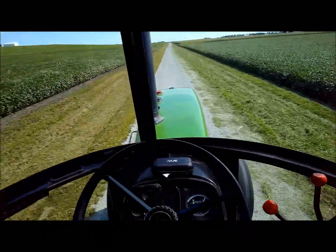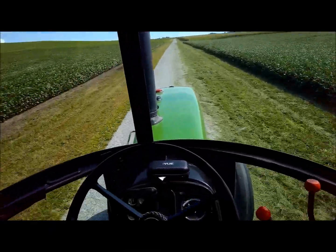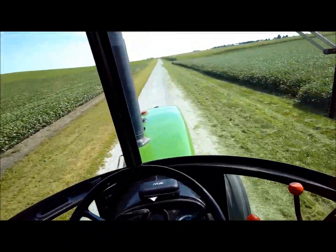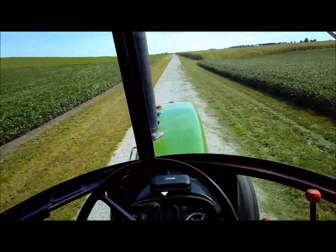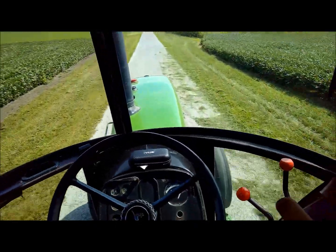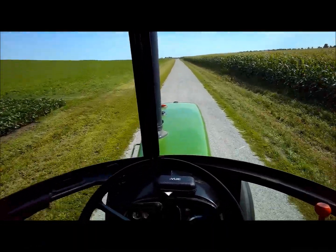he'd actually just jack the cab up 6 or 8 inches or so if you can, or jack it up about as up a ways, but keep it so you don't unhook any of the dash stuff, and then just roll the back end out from underneath it, which I think is probably what I'm going to have to do because the forklift doesn't go high enough to get the cab off, and the crane in my shop isn't high enough to get the cab off.